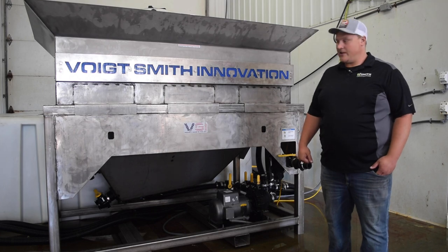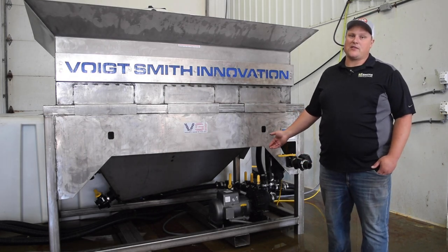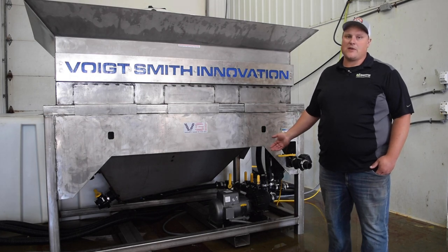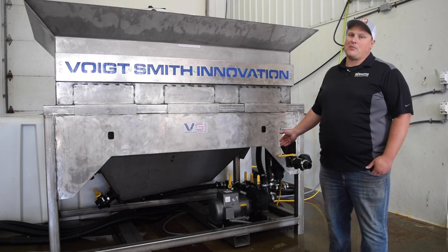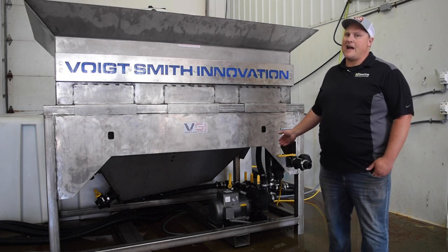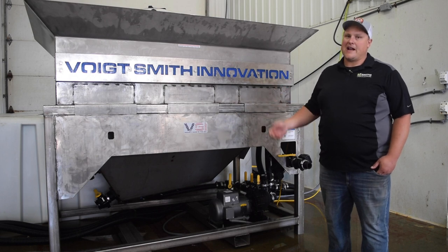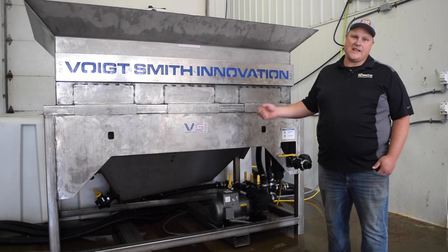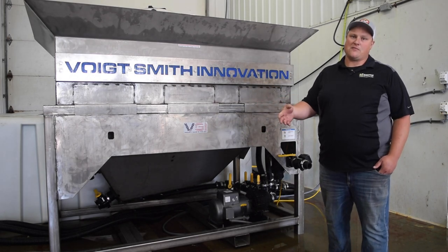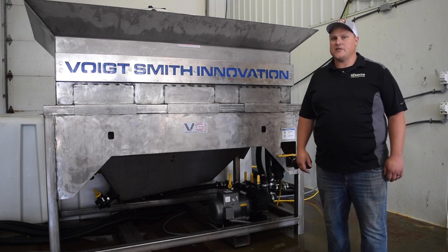And then, most importantly of anything, make sure that when you're putting the brine maker into storage or when you're going into the summer months, you flush out the plumbing and especially flush out the pump. The problem is if you leave salt brine in your pump, the water will evaporate out of the salt brine. It'll leave the dry salt behind, and salt does this weird thing called salt creep. It'll actually creep through and into the seal of the pump. That'll get into the motor, and when you get back in the fall to use your brine maker again, your motor's going to be seized up.